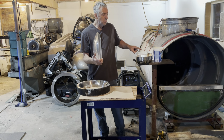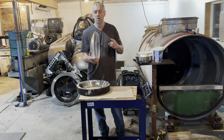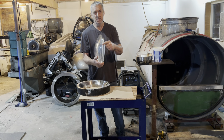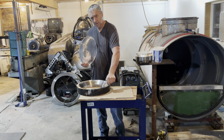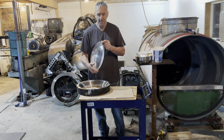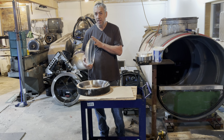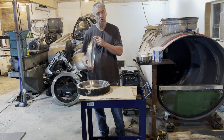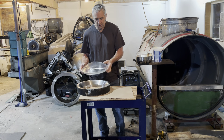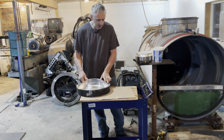The way this seals: the windows have a cork gasket which is contact-cemented to the seat but not cemented to the window. The window face just has vacuum grease or silicone grease on it, and then an o-ring seal goes in this upper corner. When the metal ring compresses it down, it squeezes the o-ring up against the shoulder. The grease is actually the high-pressure seal; the o-ring is only for at the surface and low pressure.